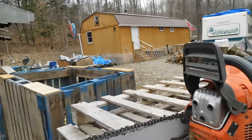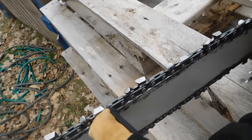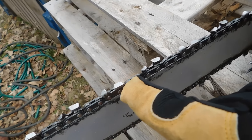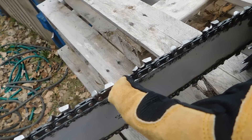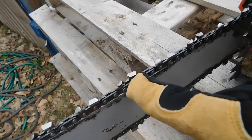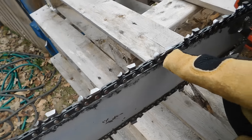I'm going to show you up on top here — you see the little groove in the top of the chain? That shows you which way you have to go when you're sharpening your chain. This one is obviously facing the other way, so I'll have to turn the blade around when I'm doing that.